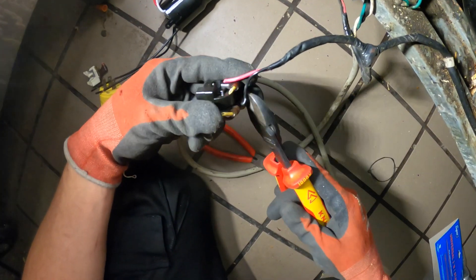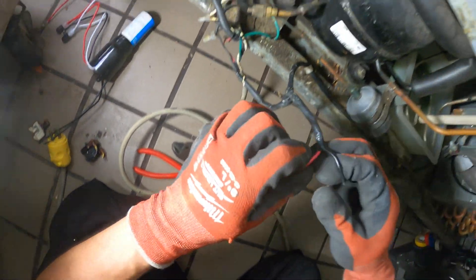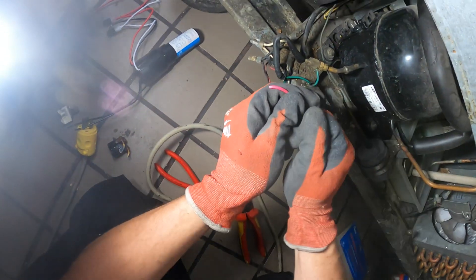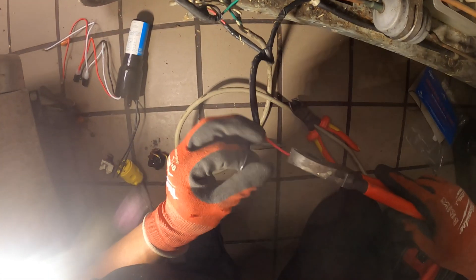This black wire is another power wire — that's going to be our power coming in. Let's move this back a little to give us more space to work. Strip that back and let's set this up. I've installed plenty of these and I've never really incorporated the capacitors — a lot of times you just don't see them. It doesn't matter; usually you just connect directly to the compressor and the kit does its thing.